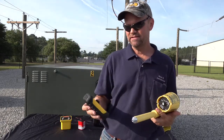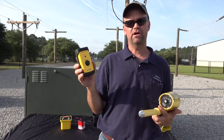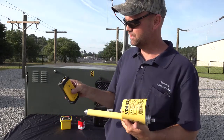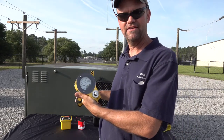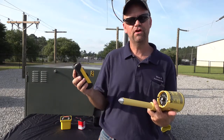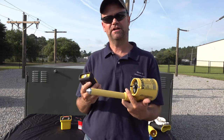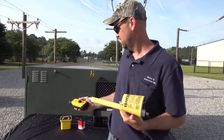What I mean by 100% test is if you incorporate our handheld power supply, part number HHPS — turn this to the on position, depress the little button here, and you'll see the needle deflect to about 7 kV. That's a 100% test: it takes a known voltage, touches it to the conductor on the probe tip, and the meter has to deflect — or not deflect — depending on whether it's working.